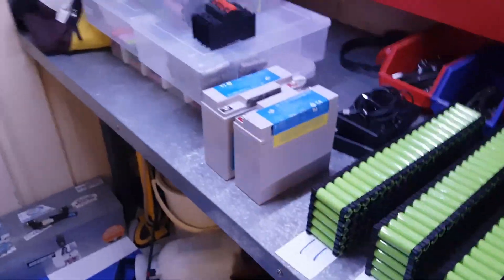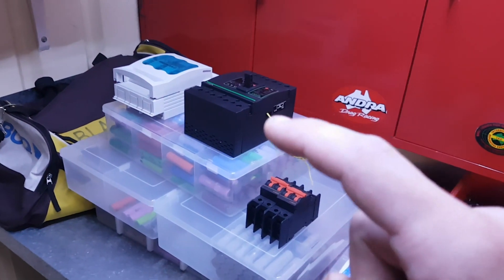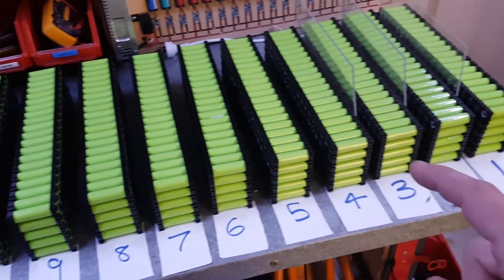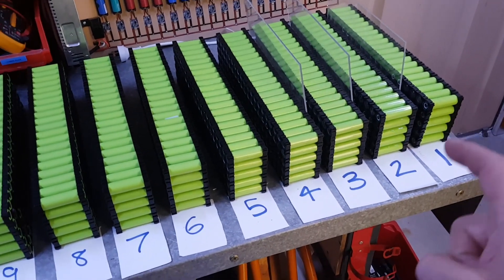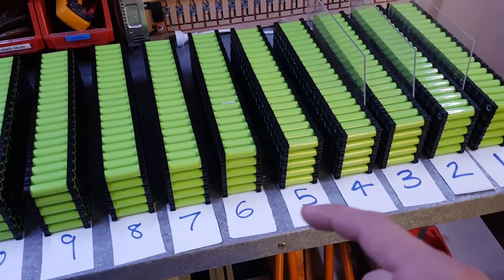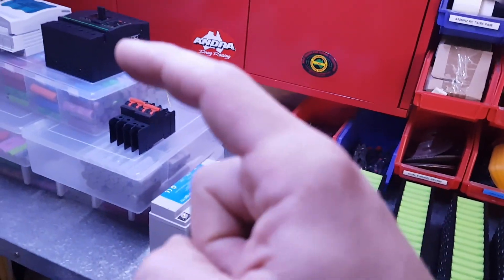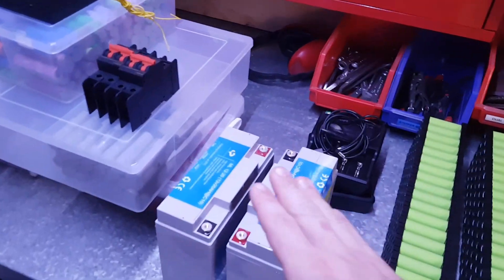There are a few more boxes of batteries in here if I need them. So why the SLAs? Basically, my trip shunt over here requires 24 volts to activate — a 24-volt power supply. Now, obviously our 14S is 48 volt, and I've been told a few times to just grab the 48 volts from each end, use a resistor to bring it down to 24, and activate the trip shunt via battery using 24 volts that way.